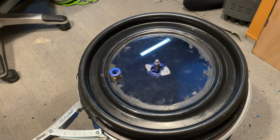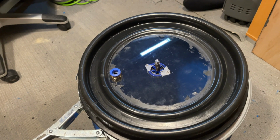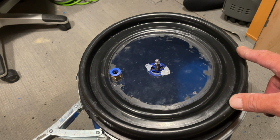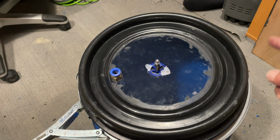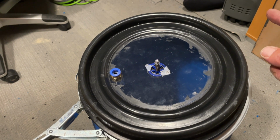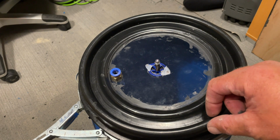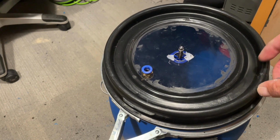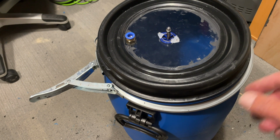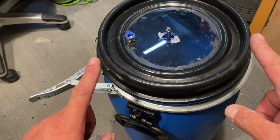Contrary to what the majority of you do, I use metric as opposed to Imperial, and that's because I find Imperial in the UK differs. There does seem to be a variance between Imperial fittings suppliers. For instance, the tank connectors vary from the rest of the pipe and subsequent fittings, and I believe somebody's done a video and they've had a discrepancy of up to 2-point-something millimeters between two Imperial fittings, which you would think would be the same. Ha ha ha, no is the case, because you've got British Imperial, European, and also American, it seems. So there are a few. So I opted for metric, and I use 2 suppliers only for my pipe work.